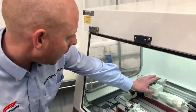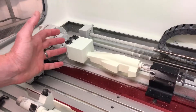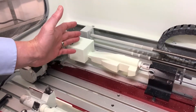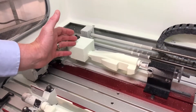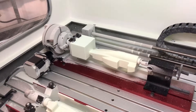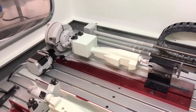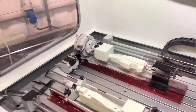If you wanted to drill on the fourth axis it's no different, but it has a slightly different commanding in the program. In the link below the video there is a sub call and the two axle hole programs which will run on our fourth axis. All that will need to be altered is the X and Y coordinates to match your design.